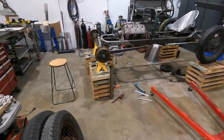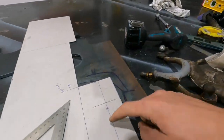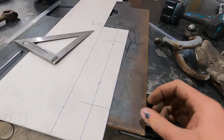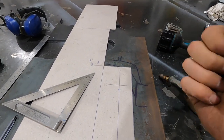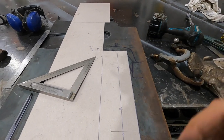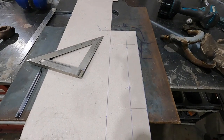That'll be sufficient. And right now, I'm gonna design a pitman arm, cut it out of some 10 mil steel, probably add another piece of 15 mil on the outside to really strengthen it up, and weld it. And then maybe I'll put some silicon bronze in there and blend it all, make it look somewhat vintage. So I'm gonna do that now.